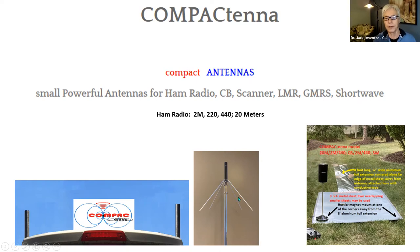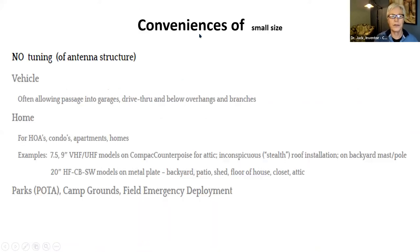Once you basically get it near the corner, it's plug and play. This is a very plug-and-play system with obstruction-penetrating capabilities. People have taken it into attics and because of the obstructions in the environment, the single-polarized antenna didn't do the job. This uses elliptical polarization. It's a 20-inch-only HF antenna. People get very excited — they're talking all around the country on a 20-inch antenna, and we're still climbing on the 11-year solar cycle.